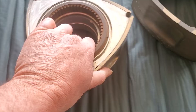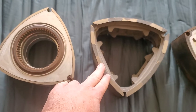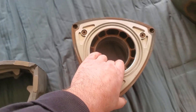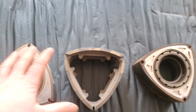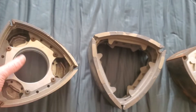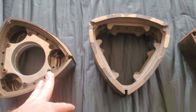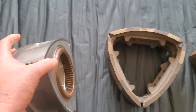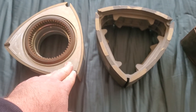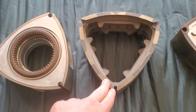Really neat stuff. In these castings that Mazda Trickz did with some other partners, they did end up redesigning the rotor. In our original trial and work we were still working with OEM rotors, so the oil galleries were still maintaining their OEM shape. I have a lot of opinions on this — if anybody ever wants my consultation on one of these projects, I'm happy to talk. But in this case, Mazda Trickz ended up redesigning the internal structure, which is part of the oil capacity, the balance, and the weight. So all in the name of trying to reduce that internal spinning mass from the rotor. One of the issues we had outside of tolerances was in the casting itself. We would probably do 3D printing now, but 3D printing wasn't really affordable 10-plus years ago, so we ended up going with castings.